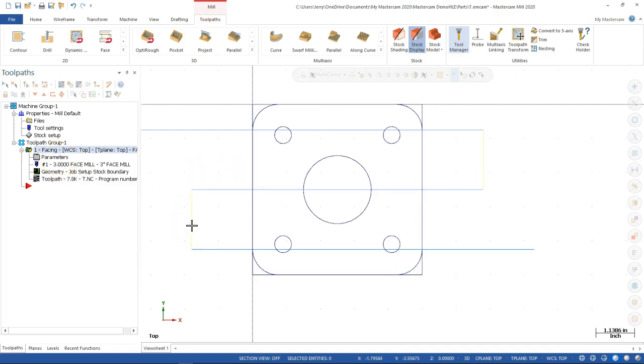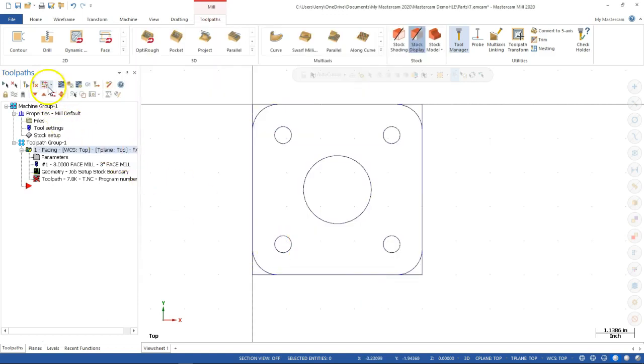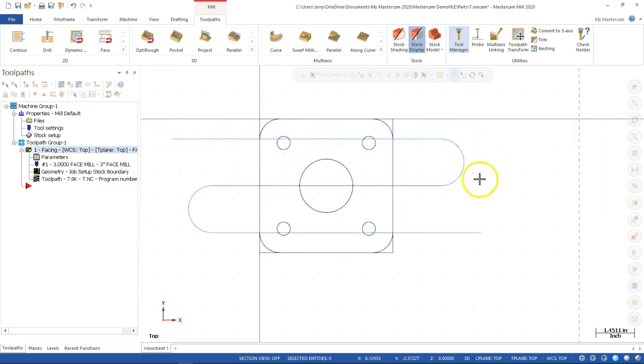If we're still engaged in the part, if we didn't account for much, that's going to come down and be a very exciting transition. And then the high-speed loops. All right. So it feeds off, makes the arc. Again, it's not having to stop, change directions. You know, even at 16 inches a minute, that arc is going to be smoother transition than coming up, making a 90-degree turn, or coming up and going into rapid to the next position.